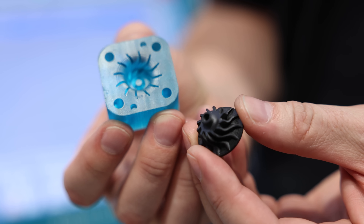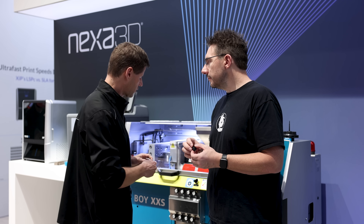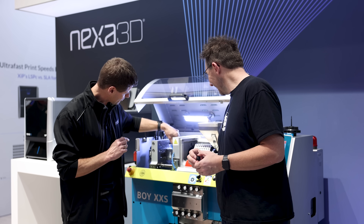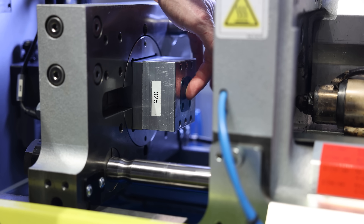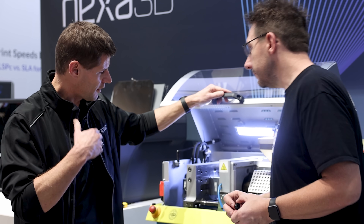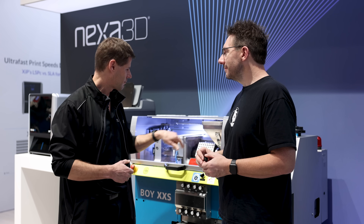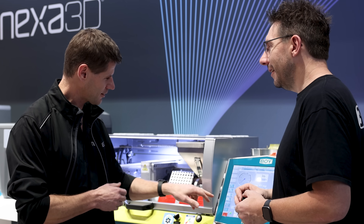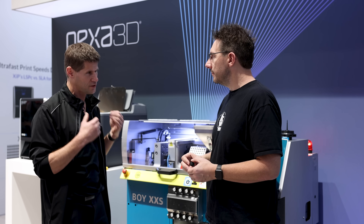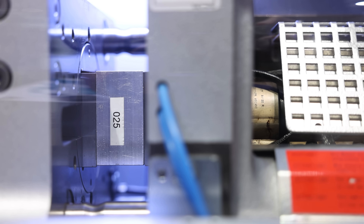I've got my $6 tool here. Normally I would use screws in these corners to keep the mold tight, but since we're at a trade show I'll skip the screws. I'm inserting my mold cavity into the injection mold machine — you've got this mold frame, it's brutally simple, it just stabilizes the tool. The injection mold machine heats up pelletized material and injects until the screw is empty. I push the button and the piston moves — that's a very good sign, it means material got squirted into the cavity.